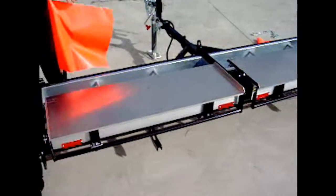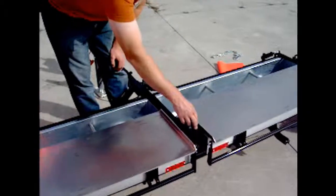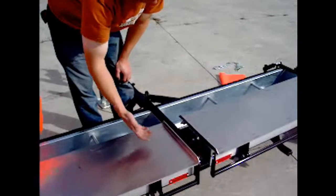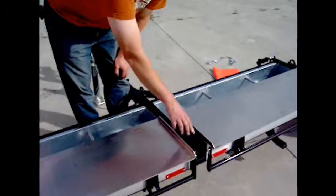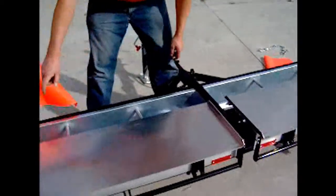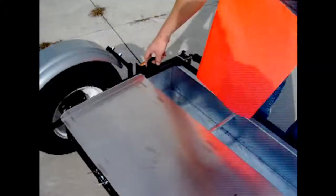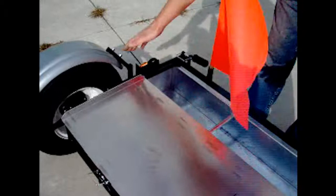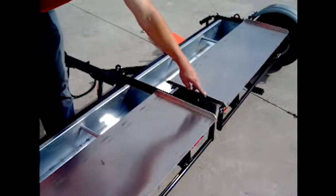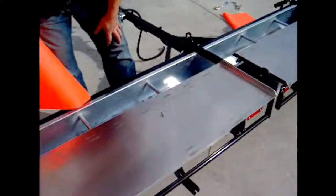Now that the Piranha is back in towing position, to lift it, you want to pick it up by these two center points. You can either stick a fork through and throw some chains over it, or if you've got some type of lifting arm on your truck, you can use your rigging equipment to pick it up here. We've also provided two other points on the sides if you want to connect a couple more lanyards to keep it more stable. Picking it up from the center is very stable — that's how we lift them — and we don't seem to ever have to use the outer points, but they're there if you need them.